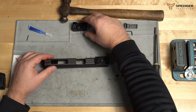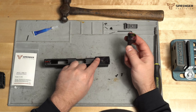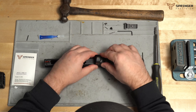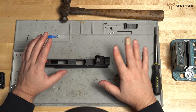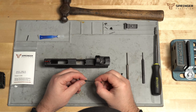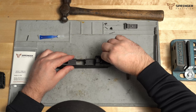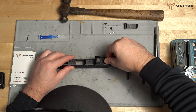The next thing we want to do is put the optic onto the plate. We provide a thread locker, and I recommend you put a little bit on the bottom so that when you put it on it'll help secure it. We do have the posts, but it doesn't hurt to put a little bit on the bottom. We're going to skip that step here since we're just going to unmount this. Make sure it's on there nice and flat with no gaps — if there are any gaps we want to address that first. This fits as designed. Take the screws to mount the optic to the plate, put them in until they're just finger tight, then set them down just a little bit more — maybe a quarter to half a turn. We don't want to over-tighten and strip it out.